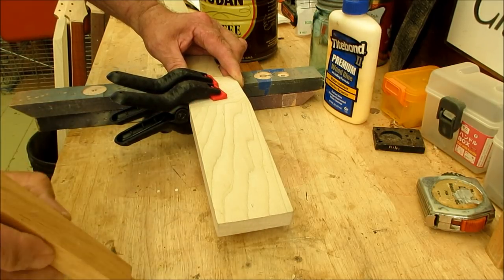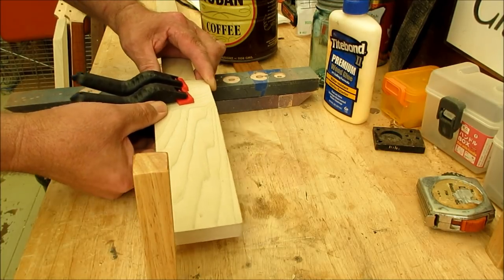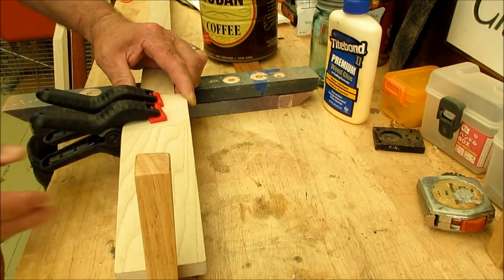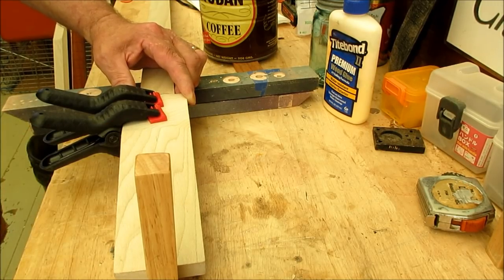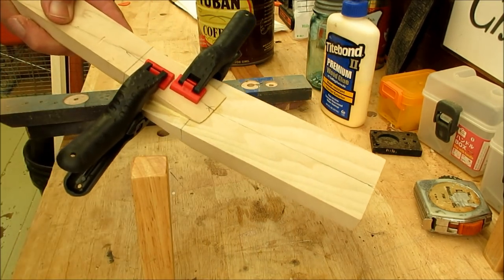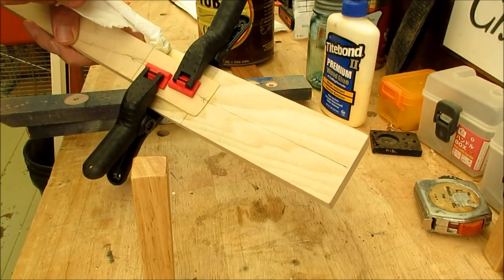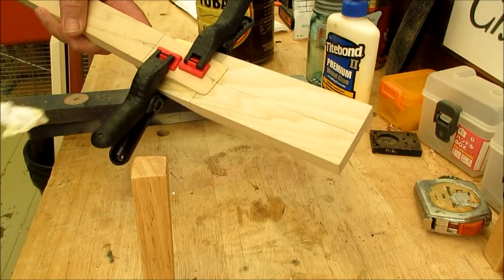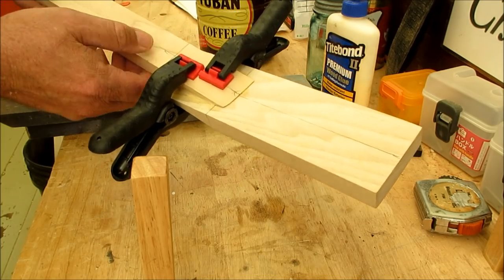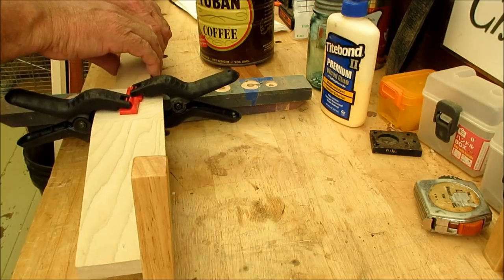And I don't want that. So, did you ever notice that there's holes in your worktop bench? Those are for these pegs, which you can put there to line all this up until the glue sets. Okay, there's the underside. I can take a pencil with a piece of paper towel on it and get some of that excess glue off of there. I want to make sure again that those marks are lined up good, and that this doesn't drift down. It has a tendency to do that.